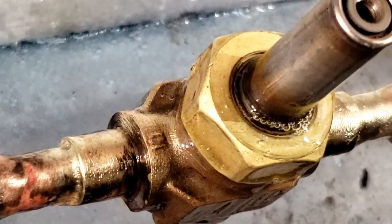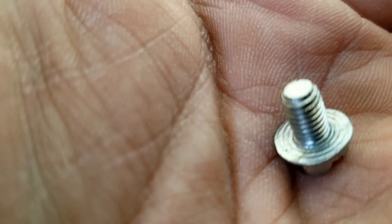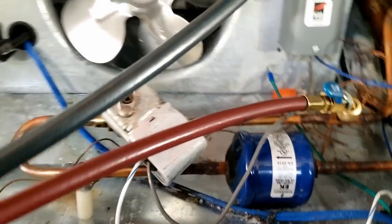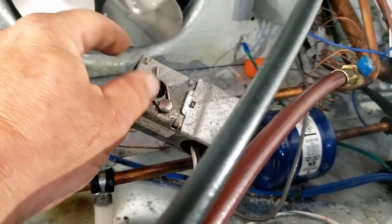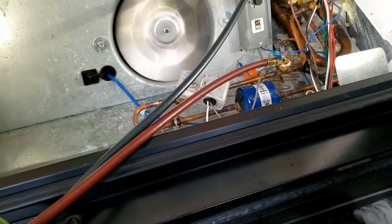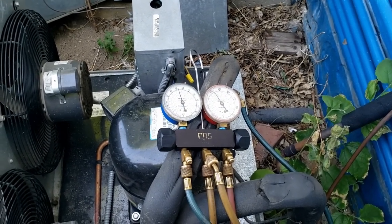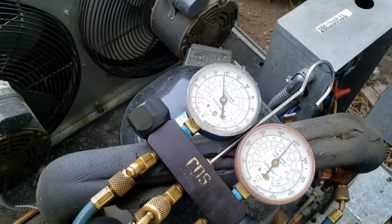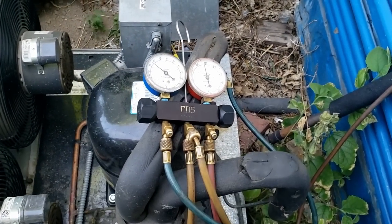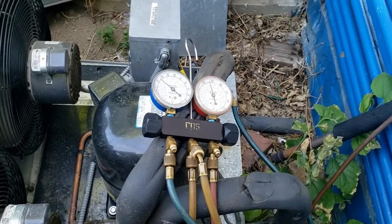You might have to tighten that up a little bit - there's probably just air sneaking out from around the stem. It's about 70 pounds of pressure so it should be adequate. We're going to get a longer screw, put it in there - works just fine, it's just a little bit deeper. We're going to make sure this thing pumps down now. That's not energized, so once this shuts down and pumps down we'll open it up and make sure she runs, make sure this thing shuts off. Looks like the fans have been coming on to the right temperature and the right pressure.